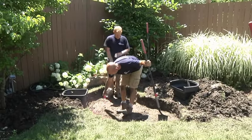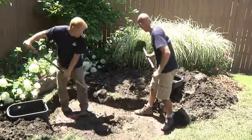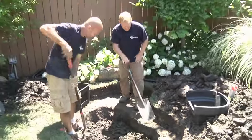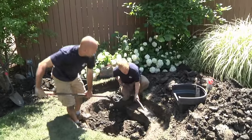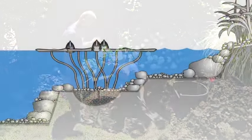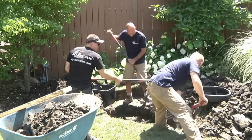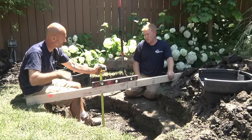Proceed to mark out and dig the second shelf of the pond by excavating down another 8 to 10 inches. Avoid following the exact contour of the first shelf to help naturalize the feature. Design in a fish feeding area by cutting in one of the shelves close to the main viewing area, or create a wide shelf along the back wall for a strategically placed area for aquatic plants to sit. There are no limits to your design — just be sure that the vertical walls are cut straight for ease of rock placement and structural integrity, and the pond shelves should be flat and leveled to handle the rock and gravel that will rest on them. An optional third shelf can be excavated as long as you don't exceed the maximum pond kit depth of 24 inches.